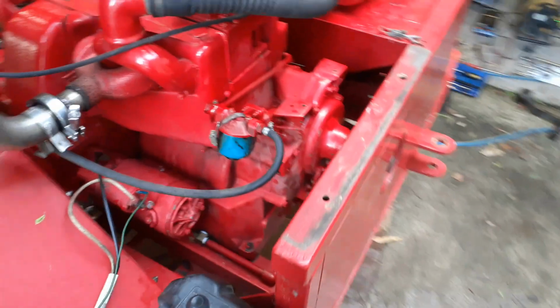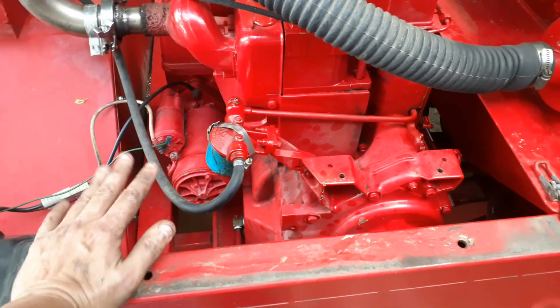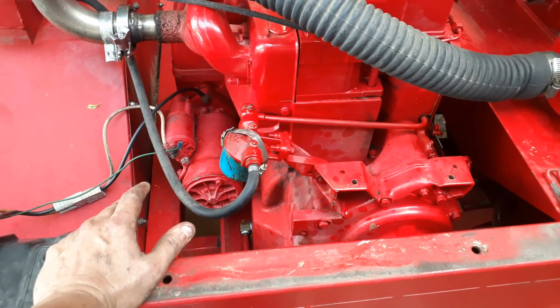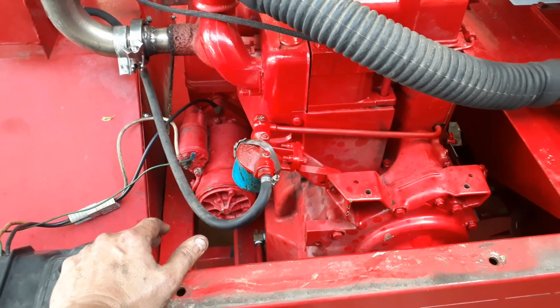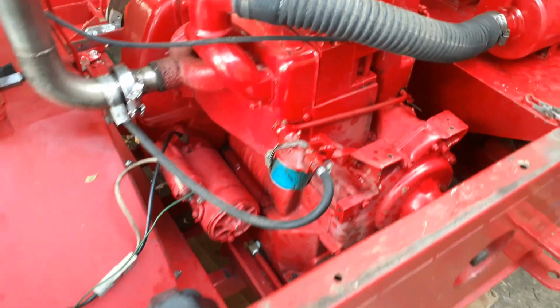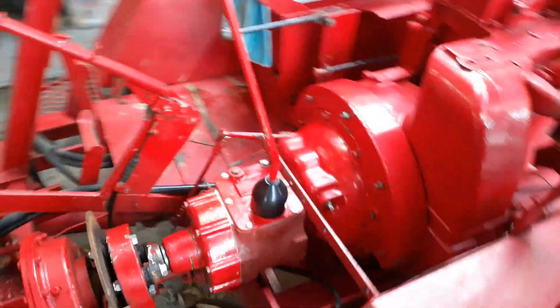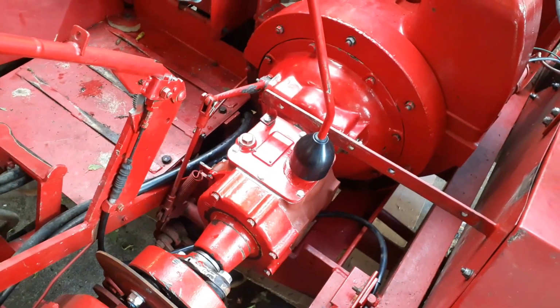I have connected all the clutch up and it works, and I have bled the injectors and it starts and runs. Figured out that one of the injectors was leaking and that's why the sump was filling up with diesel oil, so I've managed to fix that, so hopefully it'll be a little bit more economical now. Instead of using 2 thimblefuls an hour, hopefully it'll only use 1.